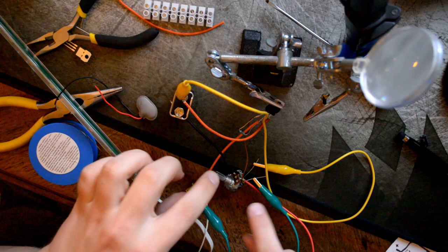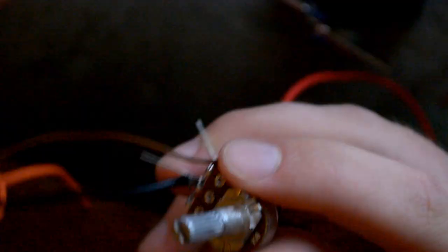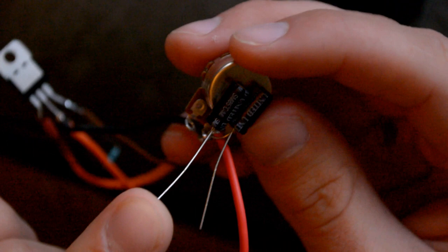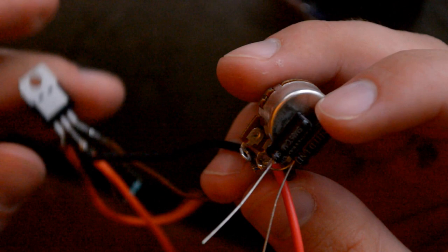Alright, the first little version is actually soldered and connected to the battery though. So if we connect it here, well, you can see the shine at the side there. We can then dim it. Nice. Here we see the potentiometer, like that. So I soldered the cables to it, and I have the capacitors to the backside here. One capacitor goes to source positive, and the other capacitor goes to current output positive. So basically the same positive that the LED gets, and this one stays with source power to stabilize that.